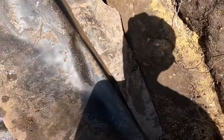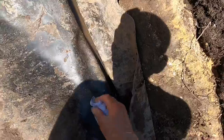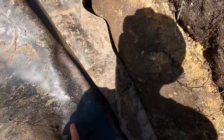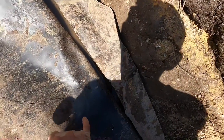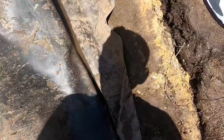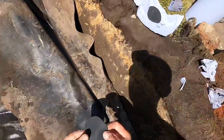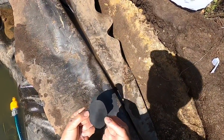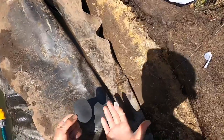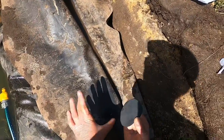Okay so I'm just tackling that damaged area of liner that I found. I've given the area a clean to get rid of all of the muck and debris, it's dried off, and I'm just getting rid of any dust, powder, and loose material. I've gone over it with a bit of wire wool just to scratch up the surface a little bit so that the glue I'm going to use for the patch has got a better surface to bond to. I'm going to put patches on the front and the back of the lining — a bit of belt and braces. I've got a couple of patches here made out of some off-cuts of green seal rubber liner. I've given these a really good clean as well because new liner is covered in a greasy film that repels water and will stop the sealant from sticking properly. For more detail on repairing liner I've got another video which you can watch separately which will go into further detail.